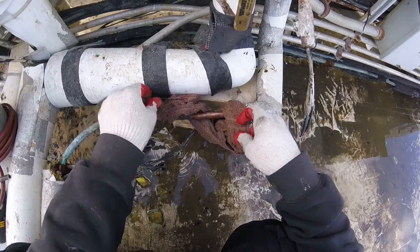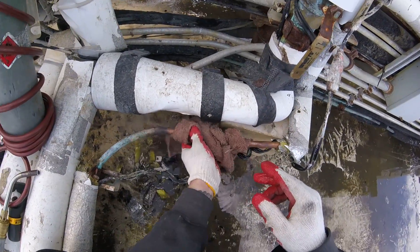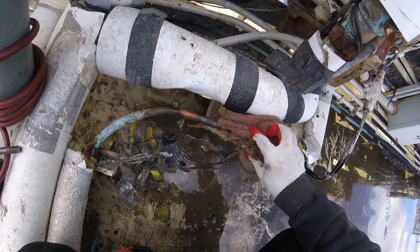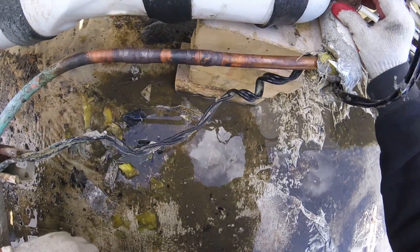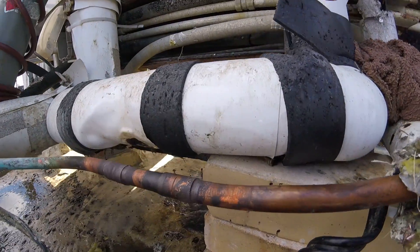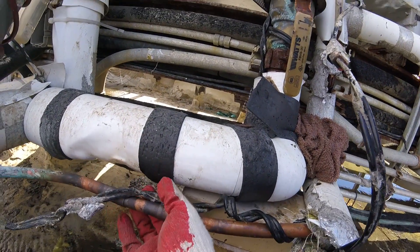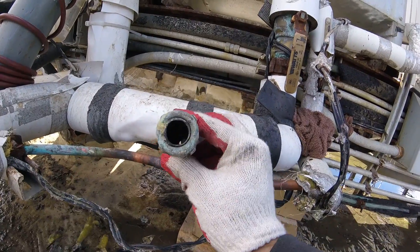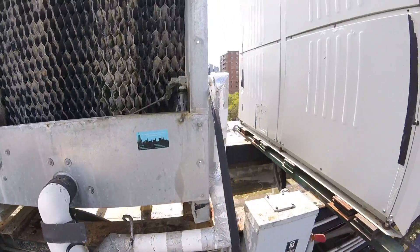Alright, looks like that was it. My partner's going downstairs, opening up the water — let's see what happens. We got the water moving; this is the supply line coming up so we know we got water in the pipe, and we have no leaks. That's how it's done. I'm just going to hook up this heat trace back around — it needs to be insulated, but that's how we would fix the leak. Got rid of this stupid thing and brazed on our new connections. If anybody found this video interesting or helpful, please drop a like, comment, and subscribe.